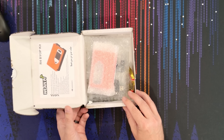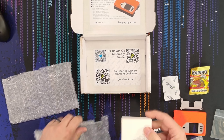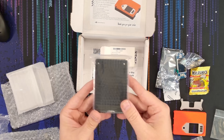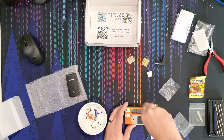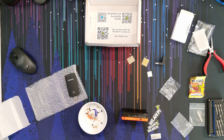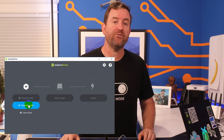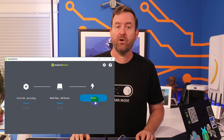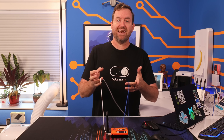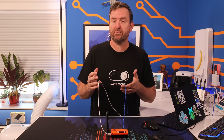Assembling the hardware was pretty straightforward. It took me about 15 minutes using the step-by-step instructions. Once completed, I had this gorgeous case ready to go with my Raspberry Pi 4 at the core. They recommend a Raspberry Pi 4 with 2 gigs of RAM or more, and this project does not yet work with the Raspberry Pi 5. Once I had the hardware together, I simply used Balena Etcher to flash the WLAN Pi OS onto a microSD card, and then everything booted up perfectly. I only have a power cord and an Ethernet cable plugged in — there's no need for a keyboard, mouse, or any sort of external display screen.